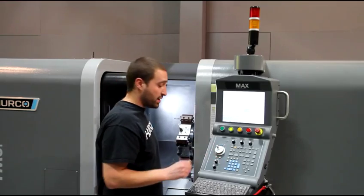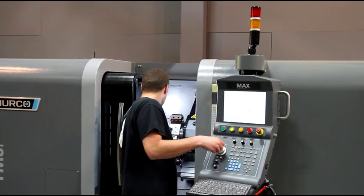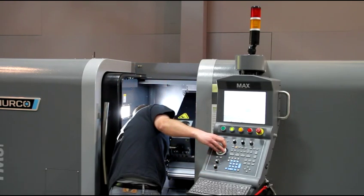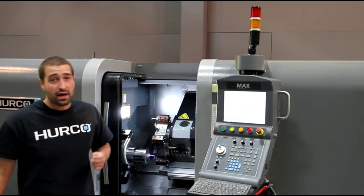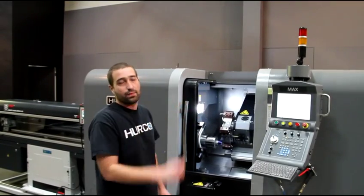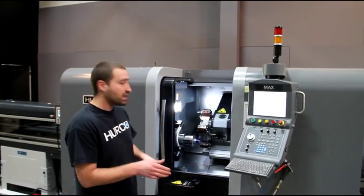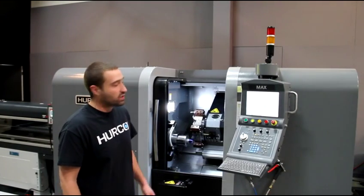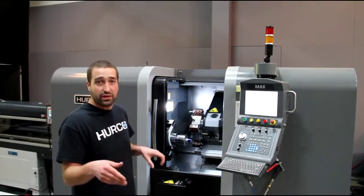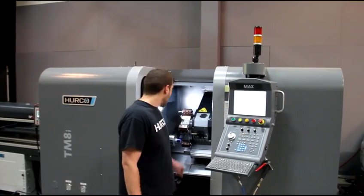I'll drag the threading tool into a good thread. It can help to use a dye light or rotate the spindle while you're doing this to try and get the threads to line up with your threading tool. The larger the part, the more difficult it's going to be because it's harder to turn the spindle. Just try to get it in there as best as you can — it's all going to depend on how well you set this position. If your threads are off in any way, it's because this wasn't dead on with the pitch of the thread.